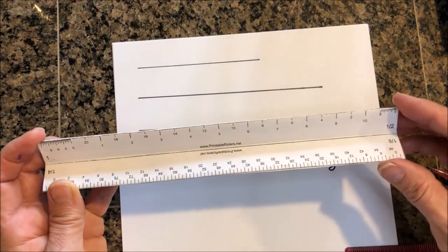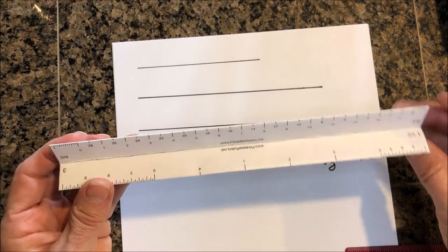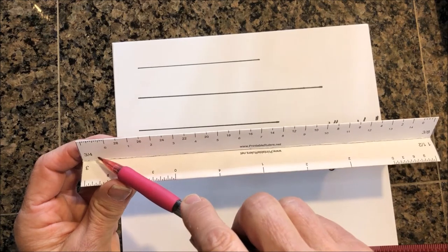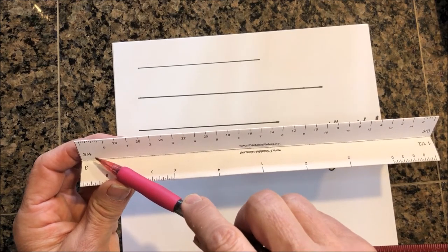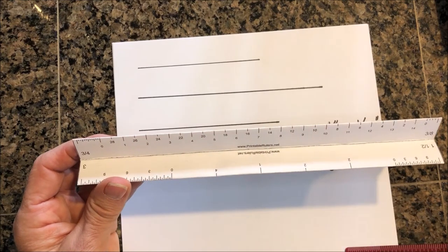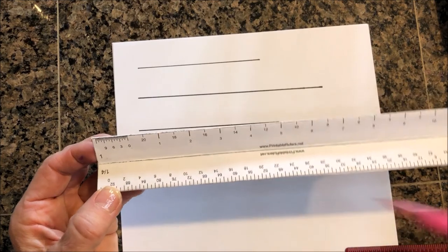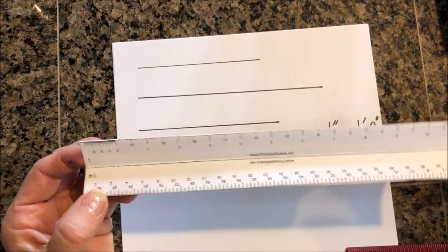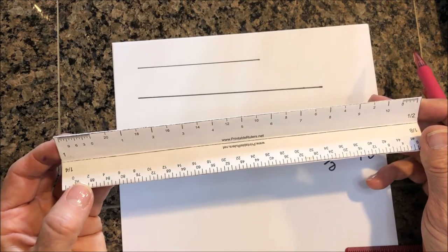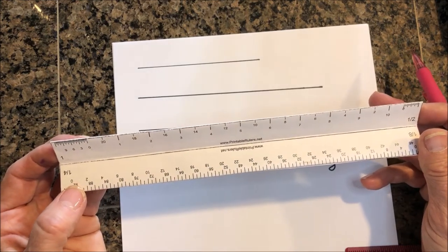You can see there are different scales all the way around this ruler. Here's the three-quarter scale right here — that's what we're actually going to use for our scale drawings and our model. I am going to show you how things work with the one-inch and half-inch first, because these scales are both on the same blade and they're easy numbers to get a feel for how to use this tool.